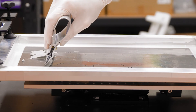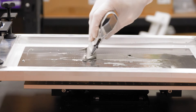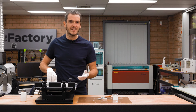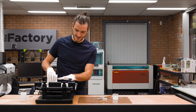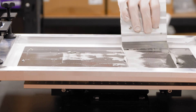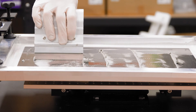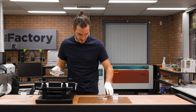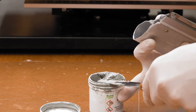If you're new to this — I still am — then have a play. I'm going to set my angle at the top of the stencil and just do a firm wipe down. I'm looking for streaking left behind in the stenciling; some areas of the stencil are completely clean and others leave behind a residue of solder paste. I've done a pass in one direction; I'd like to do at least two, so this time I'll go 90 degrees. All the pads look like they've been filled, so I'll recover the paste. If you were doing more than one panel, this would be where you remove this panel and proceed with the next.